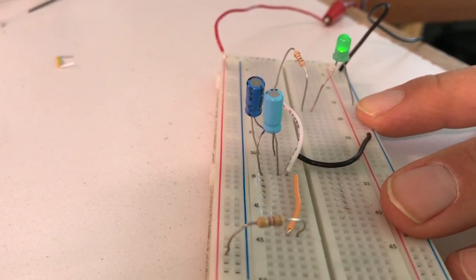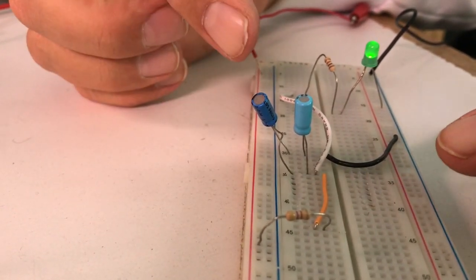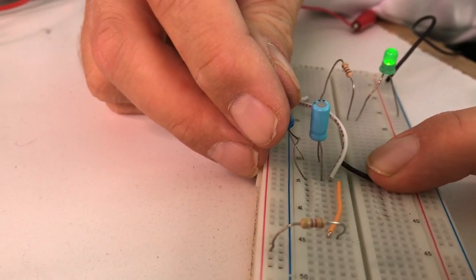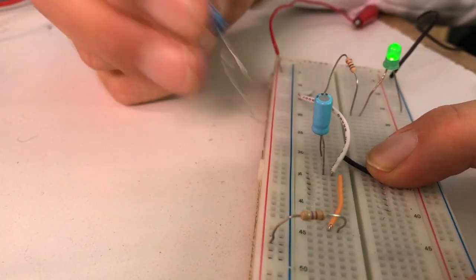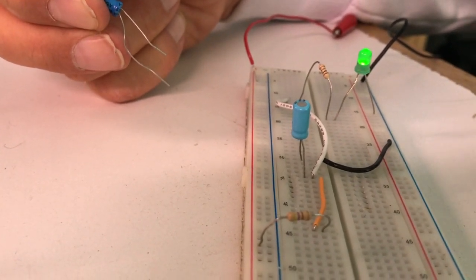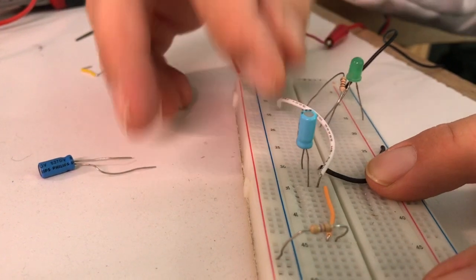One of the things we can learn here is that if I remove one of these capacitors, the reactance of this circuit would change because the total capacitance goes down. So when I pull this out, is that light getting brighter or dimmer? Look at that - it got brighter! It got brighter because the capacitance went down, so therefore the reactance went up.